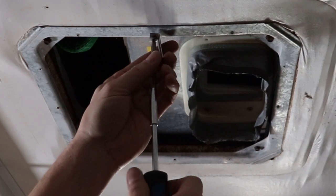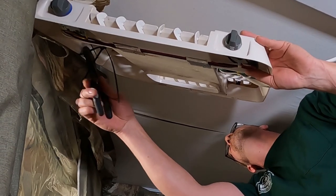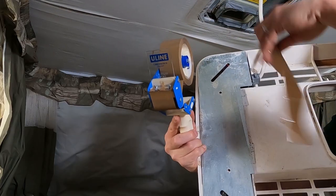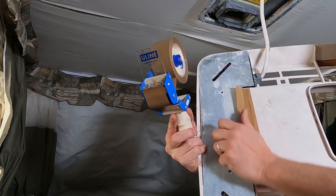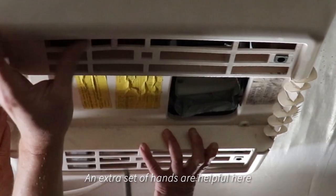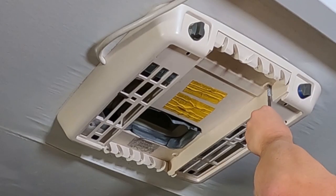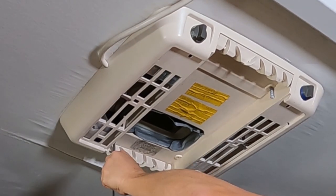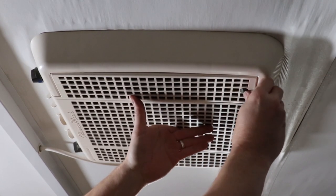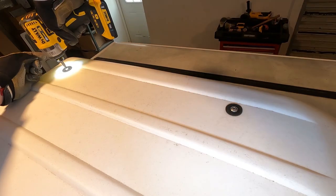Install the two hanging brackets loosely. Remove the zip tie holding the ceiling assembly out of the way and reinstall the inside cover plate. Plug the wiring harness back in and reattach the two hanging mounting tabs. Use a driver and bit to install the four inside mounting bolts — do not use a drill here. Reinstall the filter grate and tighten the two mounting bolts. Put the shroud back on with the four fasteners, and you're done!